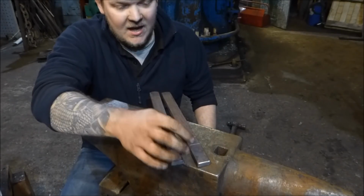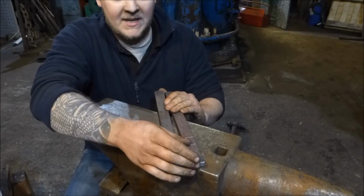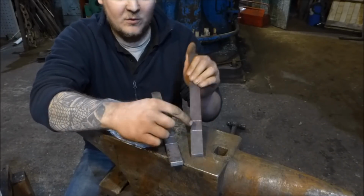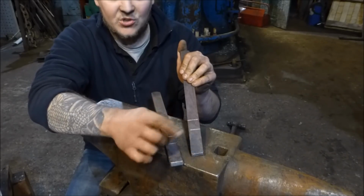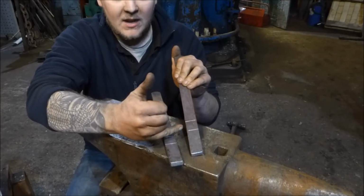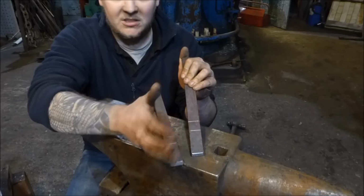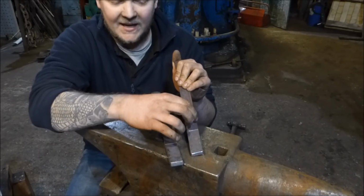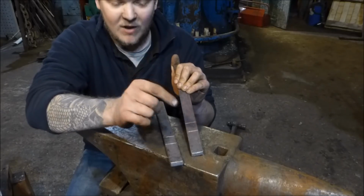Anyway, that bit over. Okay, so I've measured 60mm from the end, or 2 inches and a quarter here, and then I've marked off for the hinge plate, which is an inch. The reason I've done that is, like Roy says, it's a cube of material. This will give me the best size bosses for this piece, and then I've marked again where the back of the hinge plate is, and that's what we're going to draw out into my reins.